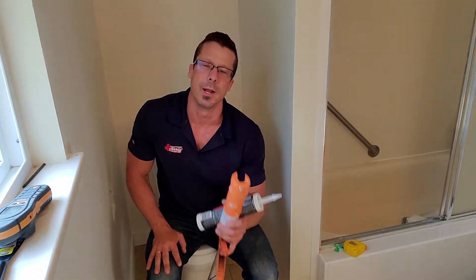There are two types of people when talking about caulking a toilet. There are those that say you should never caulk a toilet because if there's water coming out, it has to come out — otherwise it's going to go down and create water stains and deterioration. And then there are people like me that say to caulk — not the back, but from one side to the other — so that if water does come out, it comes out of the back. And once you have it caulked, it doesn't move sideways.